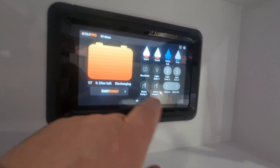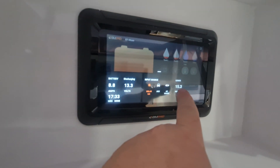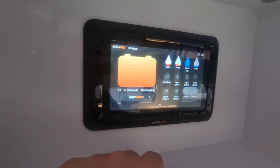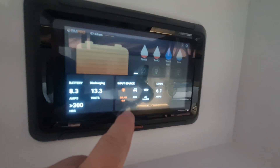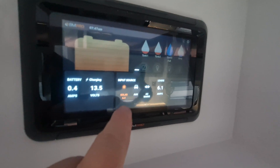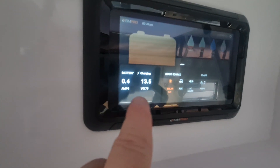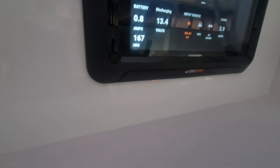Here's a quick educational bit on this: solar is only putting in 6.6 amps with a load of 15, so during the day do your best to get it into a charging state. Turn off these banks of lights - during the day you don't need that. Watch the screen: straight away you can see, after turning off some floodlights outside, we're now at a 6.4-amp solar input with only a 6.1-amp load, putting in 0.4 of an amp. Keep turning switches off and you'll see this change right in front of your eyes - it's very easy to monitor.